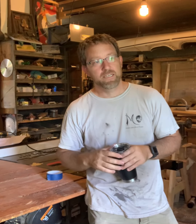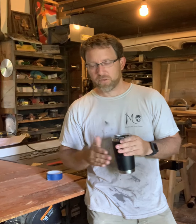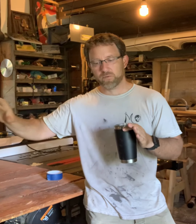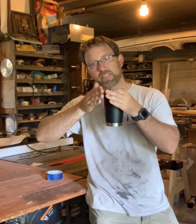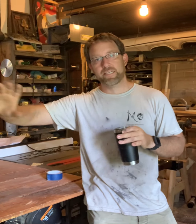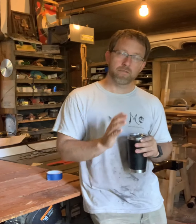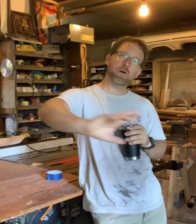And other than that, when I'm spraying back and forth, don't do those big square sections. Do it off grid. That way, when those at the end dry, you won't have any paint lines where those two had connected. So you should do a section at the top all the way and then come in and stagger that on down the building, so your paint doesn't line up in straight lines all the way down the building.